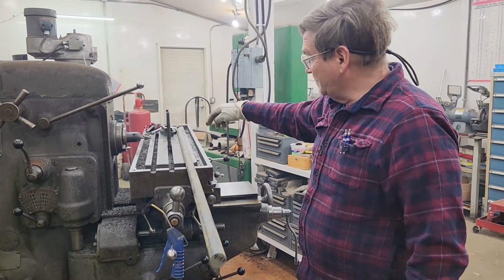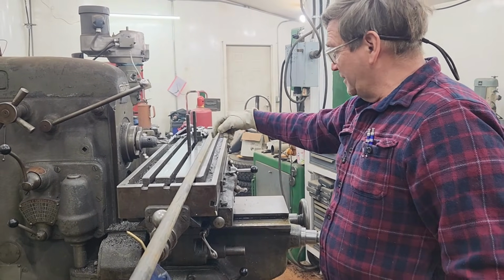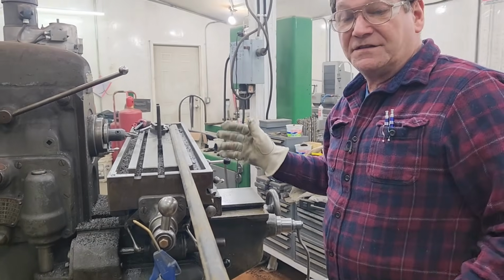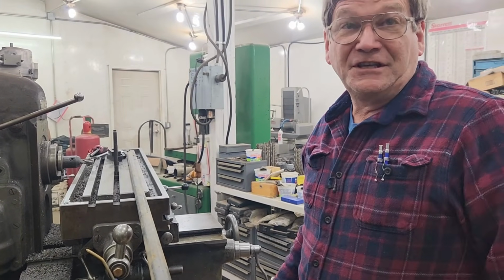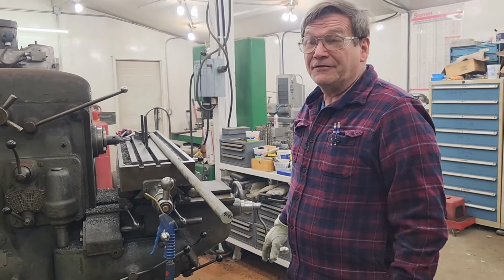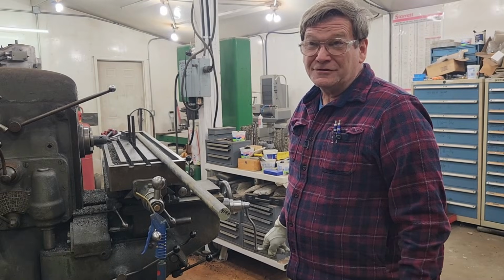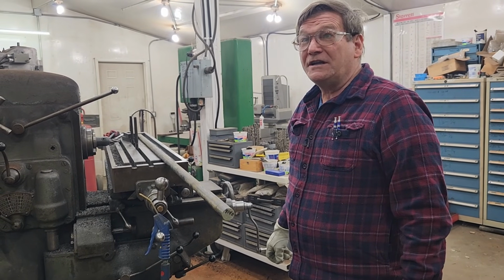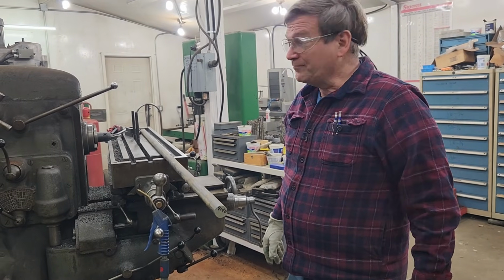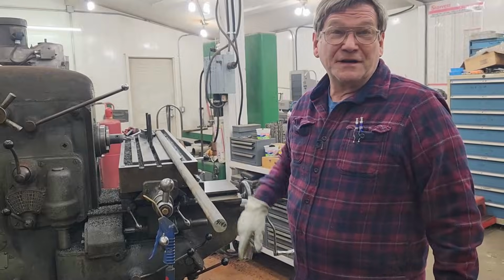Anyway, a circular saw cutter on an arbor in a mill, cutting a slot along a piece of shaft. And the job was to make the whole piece of shaft with a key from one end to the other end, which was a first for me too, as far as fully keyed shaft. I kind of think it was 1.25 inch shaft. I don't remember for sure. I remember that it was for one of the bottling companies for soda pop. And I'm thinking it was 1.25 inch, which is the bigger size for the overhead doors.